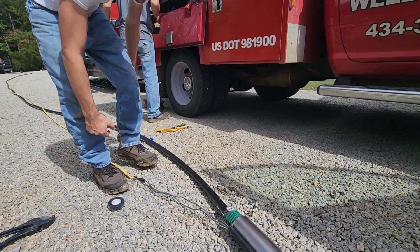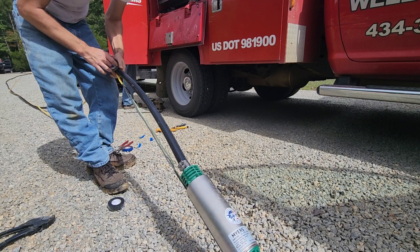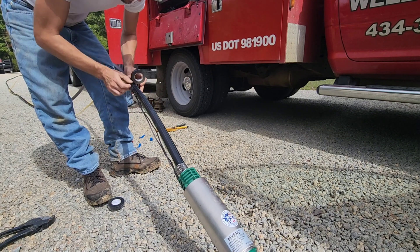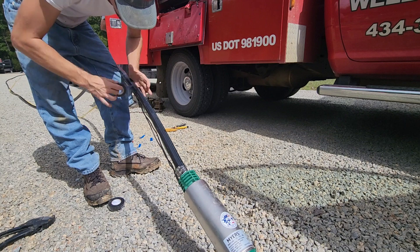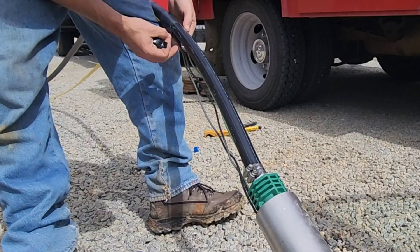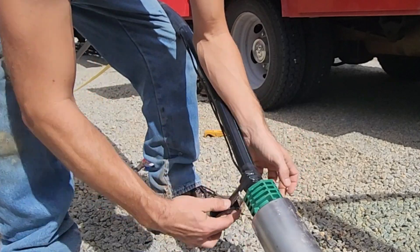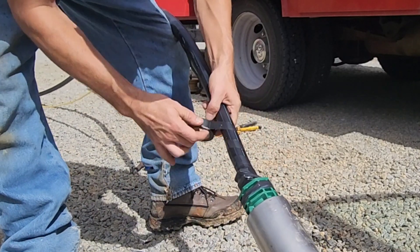Once you've done your wire connection, you have to secure the wire to the pipe — that'll allow the wire to have a long life. If you don't do this, the wire will chafe and in a couple of years it will expose the copper below the jacket. I like to cover my splice nice and heavy, make sure my clamps aren't going to interfere with the wire, keep the wire nice and flat and organized, run some tape over the clamps to help prevent them from rusting or corroding, and then do a candy cane wrap up that section.